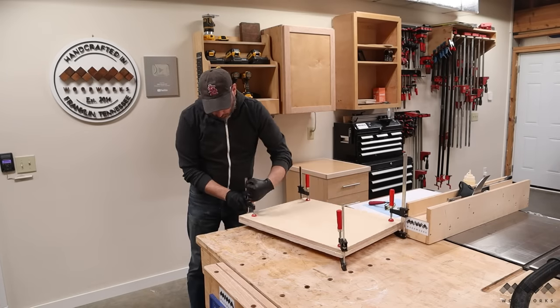Next, I'm going to cut a notch out of the back of the table to accommodate the pillar of the drill press. This will allow for a little extra depth if I need to reposition the table to drill a hole in a hard-to-reach place. I started this process using my jigsaw, but the upper cut of the blade was chipping out the Formica badly. I switched over to the bandsaw which has a downward cutting motion, resulting in a much better experience with more control over the finer cuts. I finished up by sanding the curve smooth back to the reference lines, then trimmed off a small bit of the front corners with my track saw to remove any sharp corners and improve safety. I then cut my T-track to length at the miter saw — and it's perfectly fine to cut aluminum with woodworking tools.